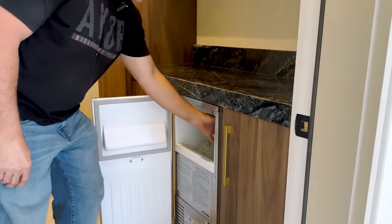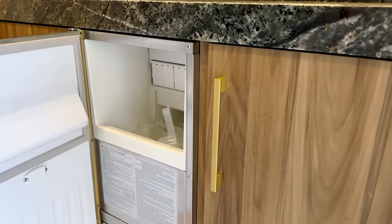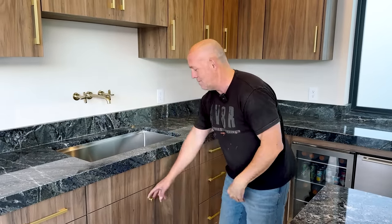However, some would ask, well, doesn't your P-trap freeze? Because yes, it would. Under this cabinet would go ice cold. The super simple solution: I used my ice maker to help guarantee it, and I also used my hot loop pipe that runs hot water through the whole house on a continuous loop I showed in a past video.